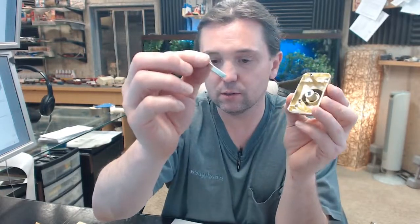That tail piece, what they're talking about, this flat rectangular spindle, that's simply going to slide right into here. Okay, and it's called a lazy tail piece because it can move a little bit without actually forcing the rest of the lock to operate. And that's for a specific purpose, which we'll talk about in a moment.